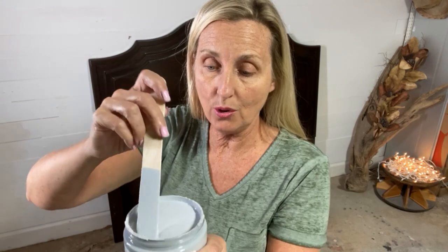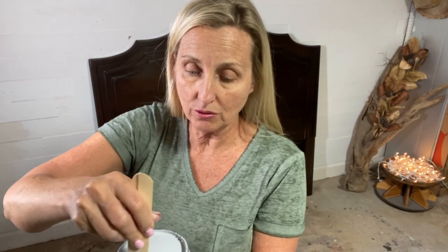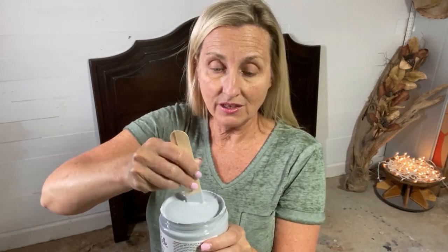This is why you stir your BOSS. I shook it for a long time but you can see what's in the bottom. After it's packaged, shipped, and sits on your shelf for a while, it develops clumps down at the bottom — those can be your binding properties, leveling properties, and adhesives. Just stir, keep pulling it up to the surface, work it out, and it will perform perfectly for your project.